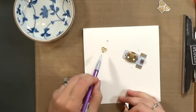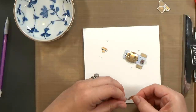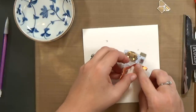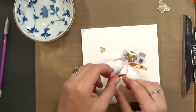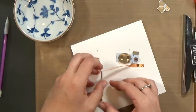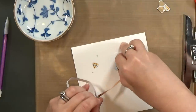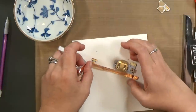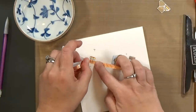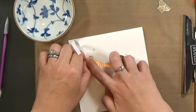And again remember: plus side to plus side, minus side to minus side. I'm just going to tape it down. I gave myself a little bit of a tail before the power pack, and I'm going to give myself a little bit of a tail after my LED sticker. That way if I've touched the copper tape at all with my fingers and transferred any skin cells, oil, or fingerprints onto the copper tape, that's not going to be where the pads are.